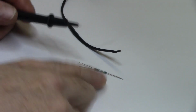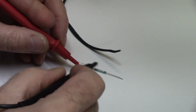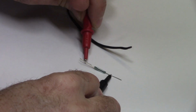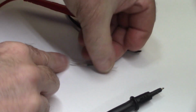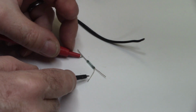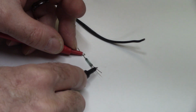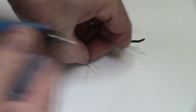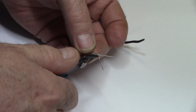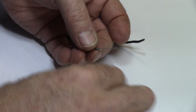Now this reed switch is a little different than most. It actually has a normally open and a normally closed side. So let's test that. This one right here, this longer one, is the normally closed, and then this one is the normally open. So that's the one we want. So we're going to go ahead and trim this off. I'll link these in the description also, but you're probably better off just using one that doesn't have the extra leg on it. And that's the more common way to find these.